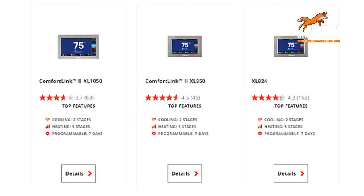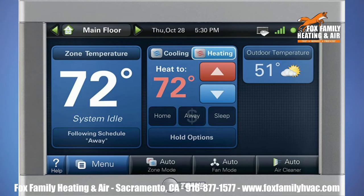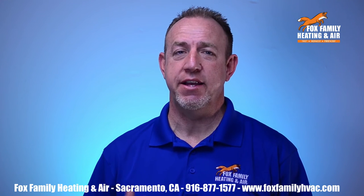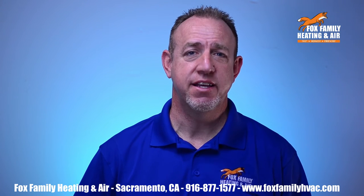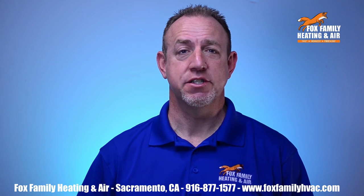Number two, you also have to have a Trane or American Standard 824 thermostat. The Comfort R function doesn't work with any thermostat except the 824 on non-communicating systems and the 850 or 1050 thermostat on the upgraded communicating systems. That's because the thermostat senses the humidity in the house and not a sensor that one might think is located in the air handler itself. So you can't use a Nest, Ecobee, Sensi, or other popular smart thermostats for Comfort R technology.